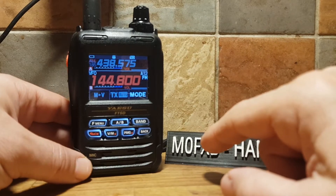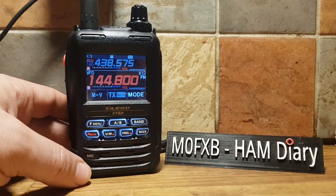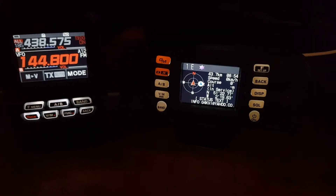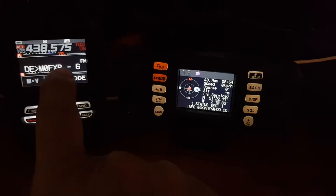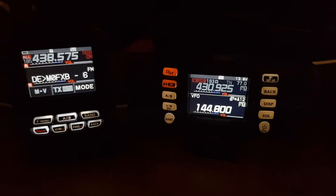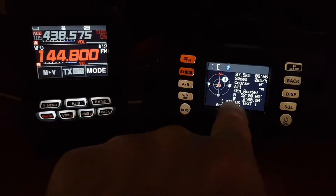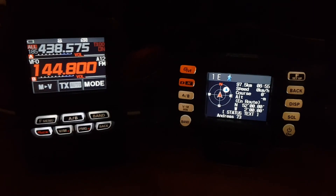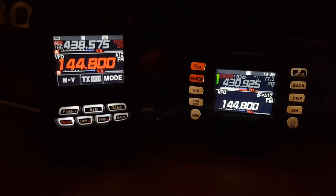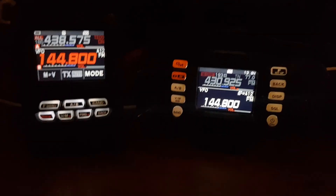I'm just going to show you it's fully working now by transmitting onto my FT-M300. You can see the 300 is receiving lots of stuff there, which is pretty good. The FT-5 has just received a signal. F and Beacon TX — there you are. I came through there, and there's my info M0FXB, on number 10. The main thing is you're getting the three beeps because you haven't got a GPS lock, so set it to manual until you do get a GPS lock. Please like and subscribe to my channel. All the best.